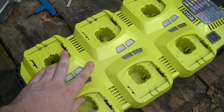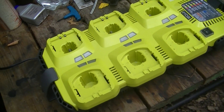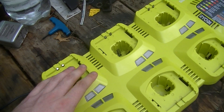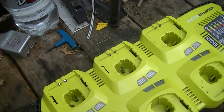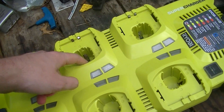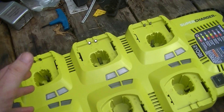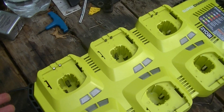A lot of people get these for having batteries continuously charged, although at least with lithium-ion batteries that isn't really necessary, because they have a fairly low self-discharge rate. Also, to get maximum life out of them, especially if you have a decent number of them, what I do is have my battery pool where most of them are stored at half charge, because that's when they last the longest. That's also why when you buy a battery, it's typically at half charge.